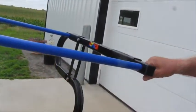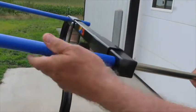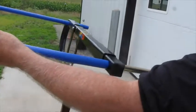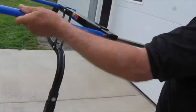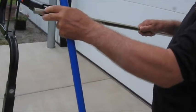The bigger, longer pins are attached to the rack with blue vinyl sleeves. To remove the pins with sleeves, do not grip the sleeve that needs to be removed. To remove the long blue sleeve, pull the sleeve against the carrier frame from the back of the rack and the sleeve will slide off.